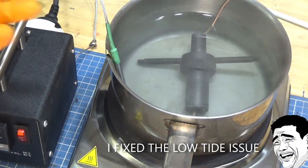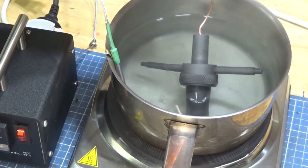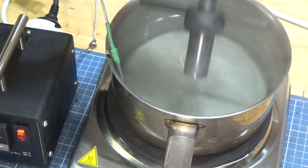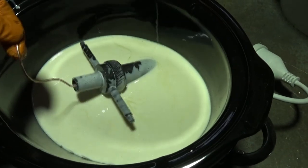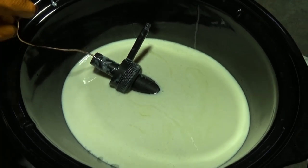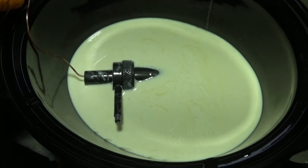Well, that's been in there about 10, 12 minutes now, and I don't know if it's going to go any darker. It's got a sort of uniform dark grey. It's certainly not black. But let's go and rinse this down and put it in the final treatment, which is our dry touch oil. Okay, just dunk that in the dry touch oil. To me, this just looks like ordinary old water-soluble oil that you might use on a lathe or a milling machine. I think the purpose of this is just to allow that porous surface that's been created by the Parker phosphate solution to absorb that oil.